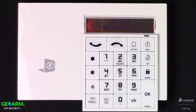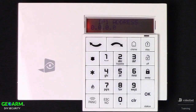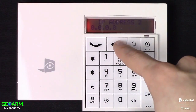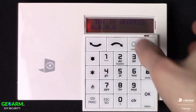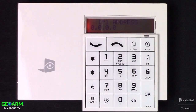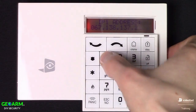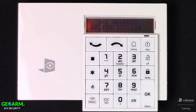Now we're at server addresses, where we can enter the IP, domain, and port information for the central station. Press OK to enter that menu, which brings us to the primary IP address. Scrolling with the arrows takes us to the primary domain, primary port — typically 888 — then secondary IP, secondary domain, secondary port, and the TMT IP address for remote maintenance. Press OK to modify the primary IP, and type it in keeping in mind that each octet needs three digits, so a two-digit number needs a preceding zero. Press OK to save, then Escape No to back out.